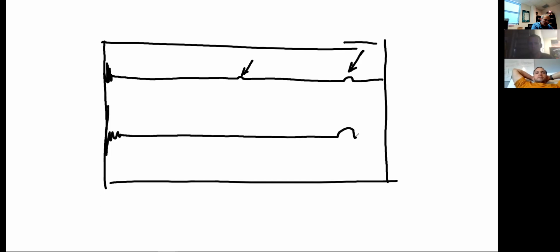I'm going to make this bigger so we see it better. If this is considered an open, remember before we had a fault location like this. When we put it in radar mode and thumped it, what did it do? It went way down like that, correct? To verify the far end, what can I do down here to make this invert and verify that I'm on the far end?